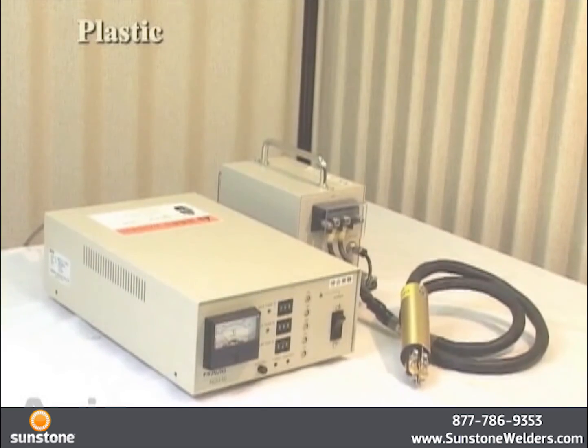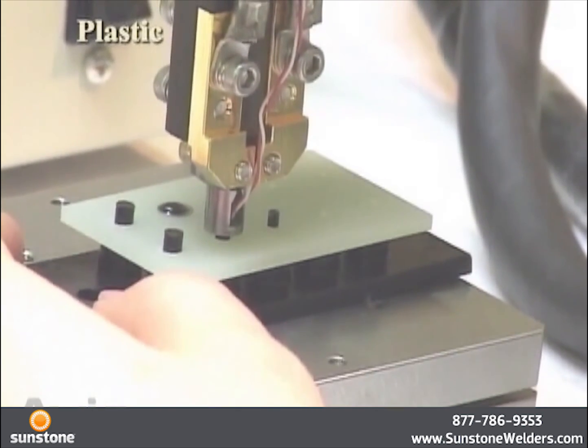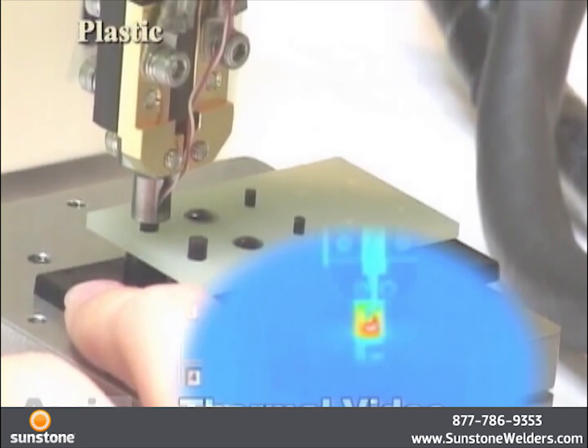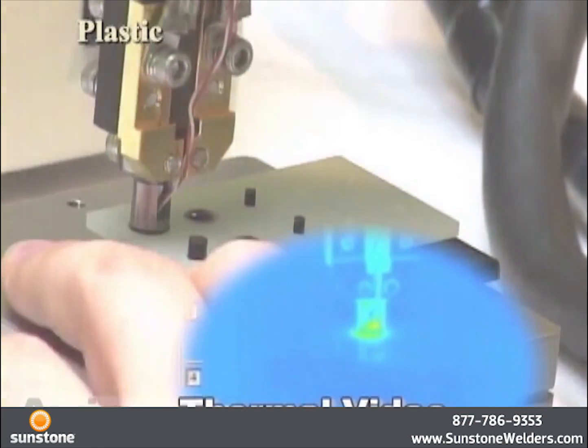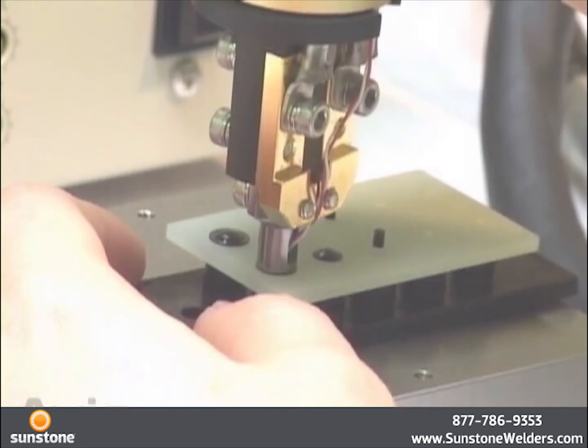This is an example of pulse heat fusing on a plastic component. The heater tip is pressed against the plastic, then pressurized and heated. Because of cooling while pressurized, high-tolerant shapes can be achieved without cobwebbing. There is a need for this method as a replacement for screws.